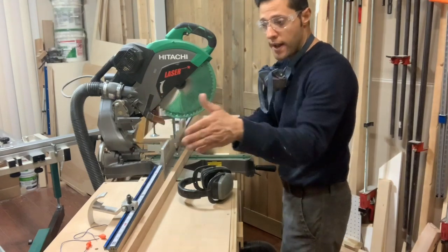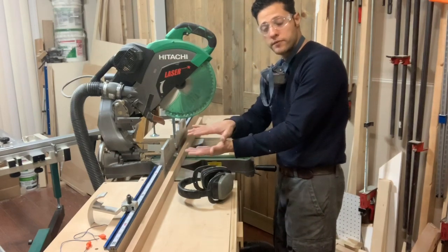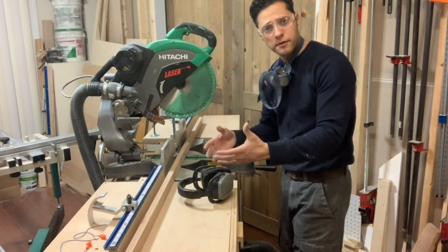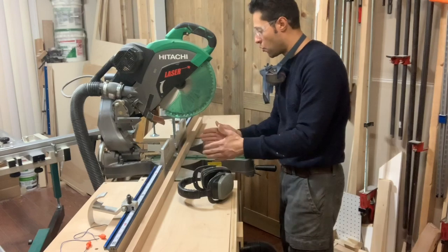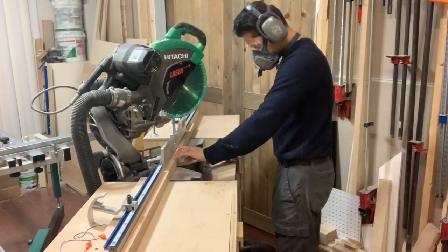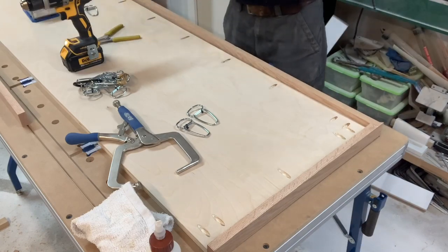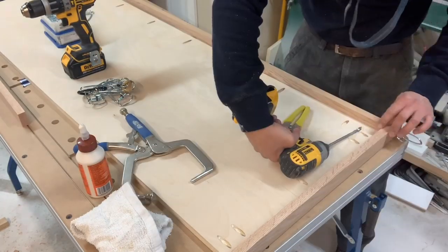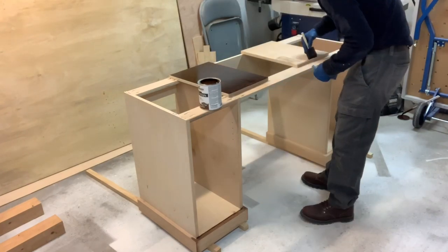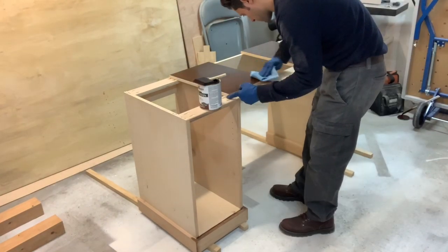I'm trimming out the top around the edges with three-quarter inch red oak, ripped to one and a half inches thick — that covers both pieces of plywood holding the desk together and gives a nice solid-looking thick top. I rolled in the miter saw station temporarily because it's more accurate for cutting these corners than doing it on the table saw. To join the edge banding to the top I'll use pocket screws and glue; since the pocket screws are on the underside they'll be completely covered by the carcasses. Then I'll apply a coat of walnut stain to match the existing furniture, attach the top, and spray three coats of satin polyurethane.